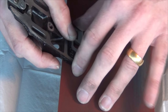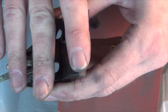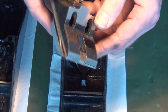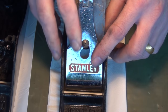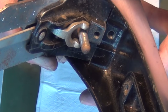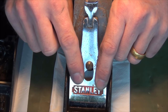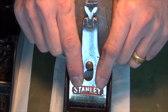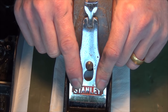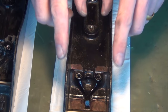Just work on these two smaller pads now - because they're smaller, take a little bit of care to make sure you're working evenly on that surface. That takes them to the same degree as the large pad, so the two planes should still be the same distance they were apart before we started. To check the fit of the frog I like to install the blade - this allows me to put the frog in position and check exactly how far forwards it could ever possibly go, then check at the back how far the two pieces are offset. With the frog installed at the most forward position you want to check for any rock. And would you believe it, this is the first plane where it's been absolutely flat with no rock - and actually the other one is exactly the same. So I've been incredibly lucky.